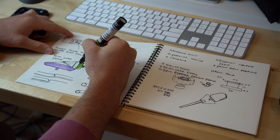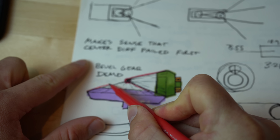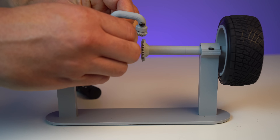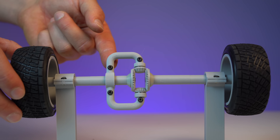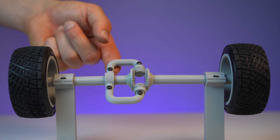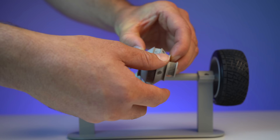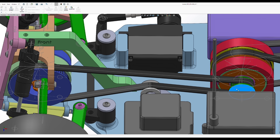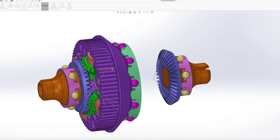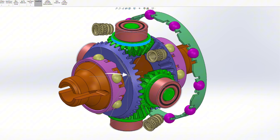Another way to think about how bevel gears are designed is to imagine they were cones extended out along their angles to meet at a virtual point in the center. You can see the virtual point these gears share and how their angles were defined. Another gear is added to share the work of driving the axles — notice how when one wheel is stopped, power smoothly transfers to the free wheel. What's unique about my differential design is that a belt rotates the assembly rather than fingers or a shaft, and instead of two spider gears I'm using four since these are 3D printed and I want to distribute the load through as many teeth as possible.